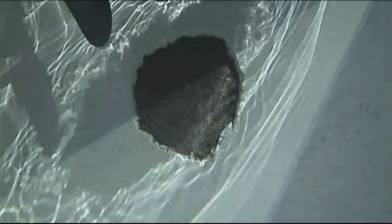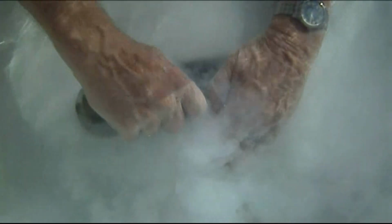Firmly apply Easy Patch number 1 Fast Set to the area to be repaired. Mainly trowel upwards. If you trowel down, you need to secure the material initially. Now trowel back and forth. Sideways is fine too.